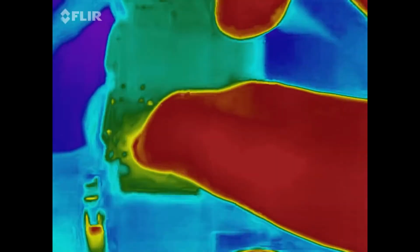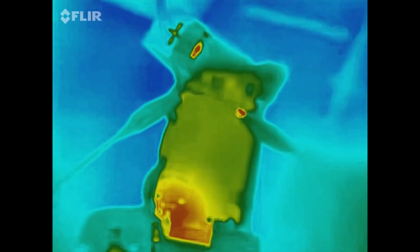It's something on the back side of the board, or the top side, depending on how you look at it, right in here. Let me do that again. Yep. Okay, so we gotta get this board out. As far as I can tell you, there's nothing there on this side of the board, the side that I can see. Oops, hit the wrong supply. Huh. Very strange. Let's see, where is that? Right in there. Okay, that off. That's the only thing I see getting warm. Okay, let's take this board out and see what's in that area.